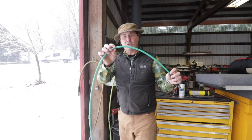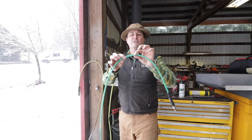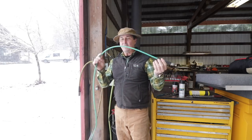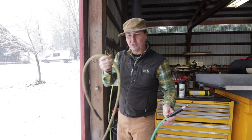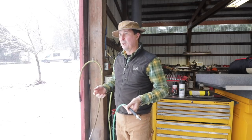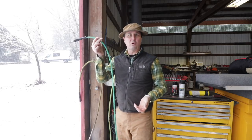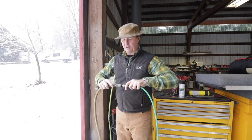I just found this stuff not very long ago. The contractors are all using it. It's a small diameter hose — really thin and lightweight, actually translucent — and it comes in 50 or 100 foot lengths. You can get it anywhere: any box store, Home Depot, Amazon. It's not shop-grade, but if you just need to run long runs out to your shop, or use nail guns in your house all the way upstairs two or three stories, you can get a roll of this and tie it into your compressor. It works really good and it's an affordable way to do it.